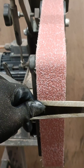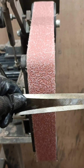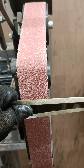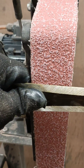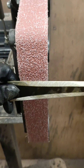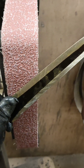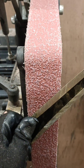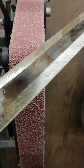When I think about how a lot of people approach grinding daggers, they'll come across the belt 90 degrees — perpendicular — which does work for getting initial grinds done. However, as you start to create a flat face on your grind, even the smallest rotation in your wrist or elbow can create problems, especially if you're new to this. So instead I bring my workpiece toward myself with the point facing up at a 45-degree angle. Working diagonally across the belt means the belt cuts less aggressively.